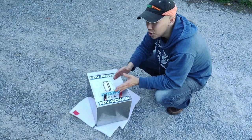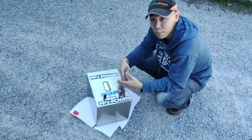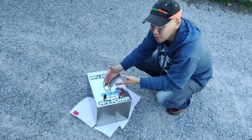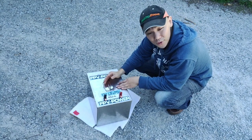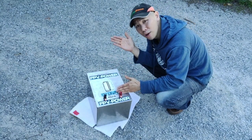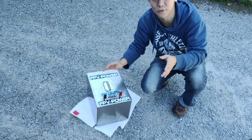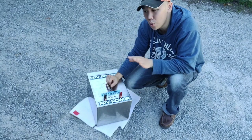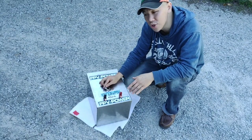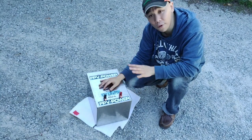So I always prefer to have solar panels which you can remove and chase the sun during the day. If you're at camp, you can move it around every 2 or 3 hours. It's better than having the angle set in one position from morning to afternoon. You miss out on a lot, and that makes a lot of difference. So with his 500 watt solar panel, much less than that since it's on a fixed position on his roof, he does pop it up on an angle, and then it stays there for the whole day.